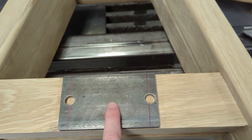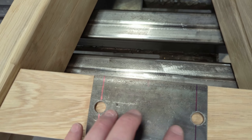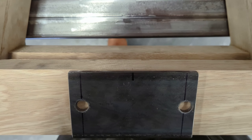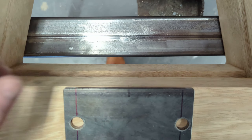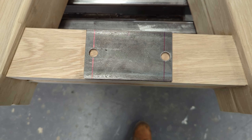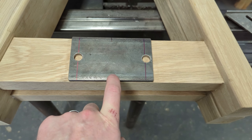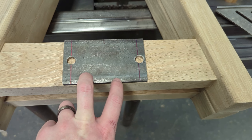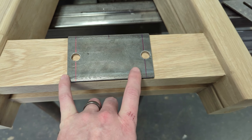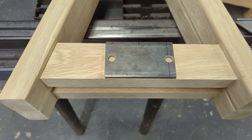Here's one of the plates that is a replica of what I have welded onto these steel cross stretchers — exact same size and hole layout. I marked my midpoint and centered it on these bench legs. I'm going to mark my hole layout on each side of each leg and drill these holes on the drill press. These stretchers will then bolt all the way through the metal plate. The metal plate is structural, but more than anything it's a visual element — we're adding little accents of steel because the client wanted a combination of white oak and steel.